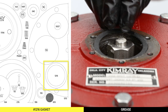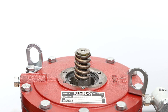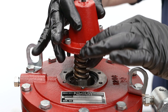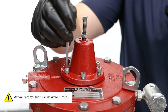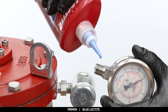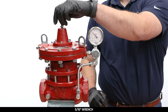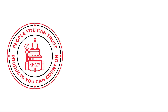Grease the surface where the gasket will go, then install the gasket, and grease the top of the gasket also. Put the spring and spring plate on the diaphragm nut, ensuring the pivot side of the plate is facing up; lightly grease the pivot on the spring plate. Attach the bonnet and tighten with a 3/16 hex key wrench or socket in a criss-cross pattern — Kimray recommends tightening to 15 foot-pounds. Apply primer and Loctite to the threads on the gauge, then install the gauge into the filter with a 9/16 wrench. Finish by installing the adjusting screw with a 5/16 wrench. This completes the repair process. If you have any questions, contact Kimray product and customer support.